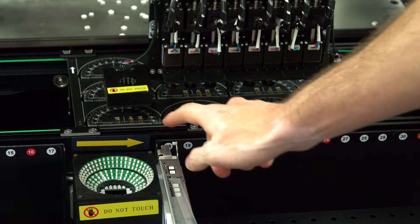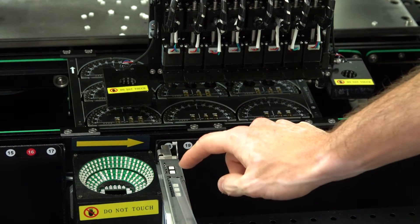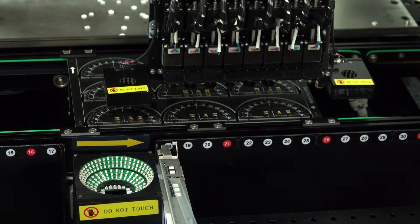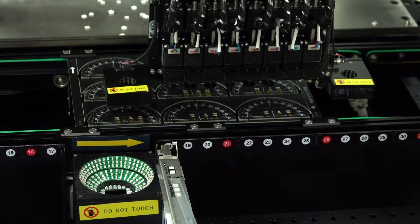I have the machine already prepared for placement. I just thought it would be good to press the pause button and capture this process. So let's head out to the factory and check it out. I have some adhesive tape on this section of the board and we're just going to pick up these LEDs and place them where they ought to go but without solder paste. The tape's just going to hold them down so we can inspect the placement.